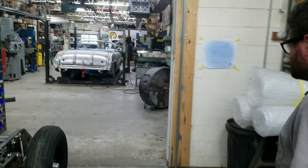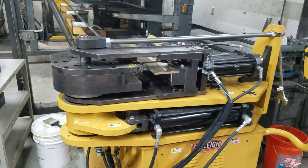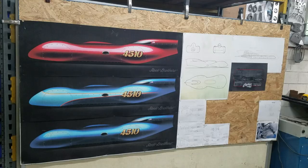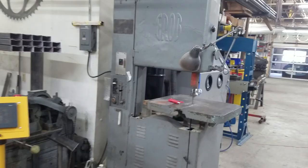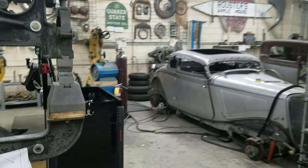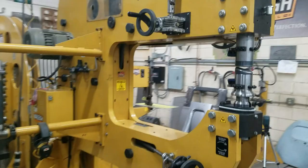Let's look at some metal shaping equipment. This is a 2x4 rectangular mandrel bender — you can see some of the bends there on the floor. Now we can bend chassis rails the easy way or the hard way. Behind it is the concept rendering for the streamliner so you can see what the finished product should look like. In this area is all our dirty stuff — CNC plasma cutting, sawing, grinding, mandrel bending. And this is our metal shaping area where we've got both our power hammers, wheeling machine, reciprocating machine, bead roller, pen tools, and slapper. All the bodies and body components we make are done in this area.